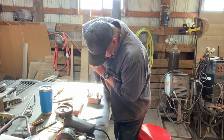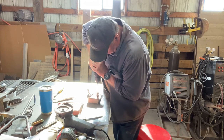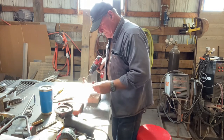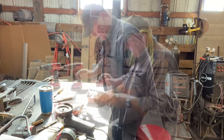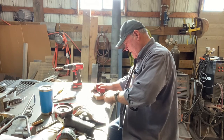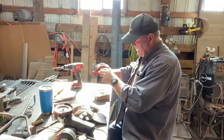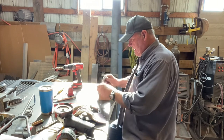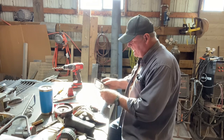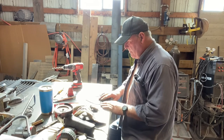We're going to drill out these four spot welds. There it is — we'll make our other spot welds right in there. I got a little bit of a pucker because of the pulling, but I can flatten that out, no big deal. We'll clean this up as best we can to use it for our main template.